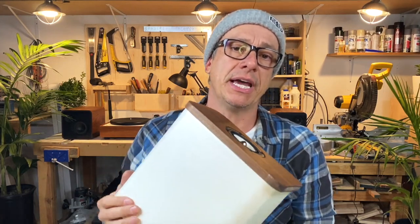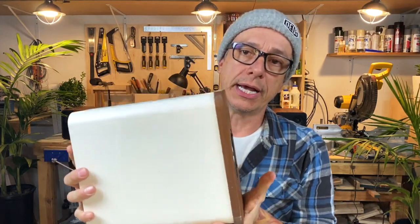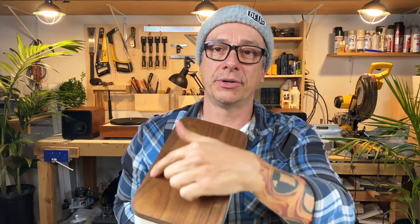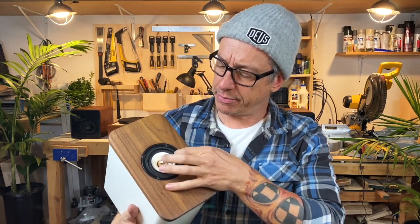The cabinet is all made of MDF. It's all glued because I wanted to round the edges, so there are no nails, no screws. The front plate is glued as well — I don't like when screws show on the front. The driver is made of paper and the suspension is made of rubber, if you can see the cone. It's not that powerful, but it sounds really good for the size. The cabinets are 4.3 liters. I used parts from Parts Express — it's a great source of everything you need for your DIY designs at home: drivers, accessories, amplifiers, Bluetooth, ports and more.